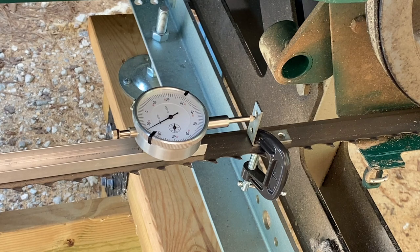I'm going to repeat this a couple times to make sure I get a consistent reading, then try my torque wrench at 25 foot-pounds and get readings from that. Finally, I'll go to the method I've been using for a long time — just setting the thrust bushing flush on the tensioning handle — and see what that does. I'll keep track of all these numbers, then come back, do some math, and see what we're measuring for tensile stress in the blade.